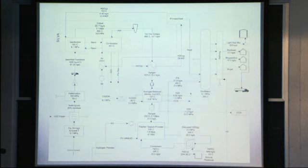And then you're also showing that sour gas was going in to your first, that amine stage. Yes. And then you also had it going into your next stage. So that's kind of a rough definition. Sour gas, we still considered it because it's relative to what's coming out. The second part is coming out of the first acid gas removal, that amine removal, and going into the low cat. The low cat is a more technical process that will further lower the stoichiometric ratio of hydrogen and CO2 to what we need. We need something like 98% CO2 removal because CO2 is highly favored over CO in the FT reaction. So we basically need to remove as much as possible. Amine is more of a process that doesn't require a lot of power or things like that. And then the low cat is a more technical process, which would let us lower it to a very low degree. So the first one's just a coarse filter, the second one's fine.